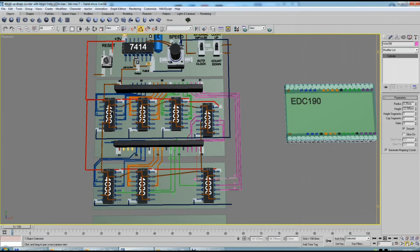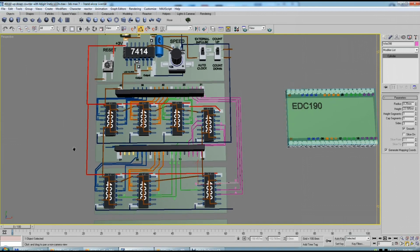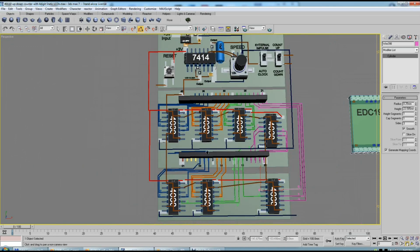So doing it my way is very big, consuming a lot of space. But if we are abstracting away the space that all these chips are occupying, it is immensely user-friendly because it is parallel input for each gate I have. So these are the inputs here. Next to B, let me actually draw it for you. All the blue lines are the outputs. And here, this is the input, and this is another input, and another input, and another input. All these red inputs are driven from my logic that I want to do, and it's extremely user friendly to do it in this parallel way, driving each input with whatever pin I please, with whatever logic I please. So that's the convenience, and that's why I'm building all this.